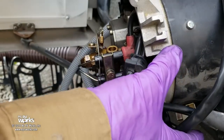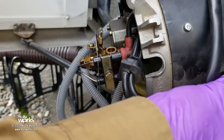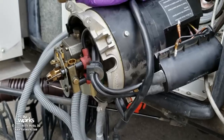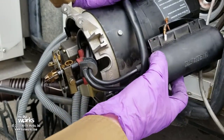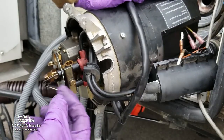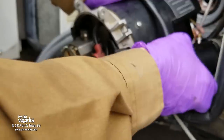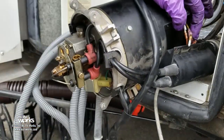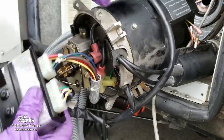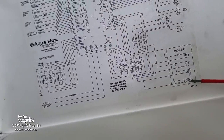What I should have done originally — and what I'm going to ask you to do when doing the spray pattern test — is take the four screws off the ignition coil on the back of the motor and disconnect the two wires. That's going to deny the system from creating a spark at the electrodes. You don't want to create a big fire. Now this yellow wire coming out follows up to the yellow wire here. Right there is the ignition coil I want to disable — for the diesel burner it's the yellow wire. That yellow wire comes out of what I think is the C plug. By disabling this ignition wire, we're still allowing all the other functions to work.